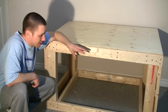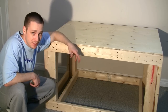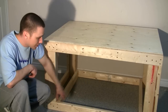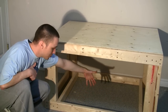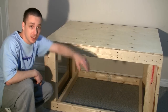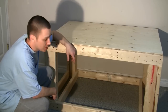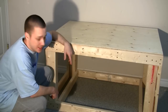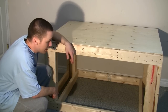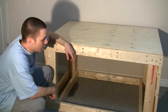If you need to make a bigger stand, this design will work for that as well. All you need to do is add more supports to the center if you're going 5, 6, 7, or 8 feet long — doing the same thing you did on the corners but placing them in the middle: a 2x4 on the inside connected to the inner frame, and one in the middle to take the weight. For a 6-foot tank you'll probably only need one in the middle; for 7 and 8-foot tanks, you'll probably need two in the middle. This design is good for tanks up to 300 gallons. If you're going bigger than 300 gallons, you're going to want to look into 2x8s and 4x4s.